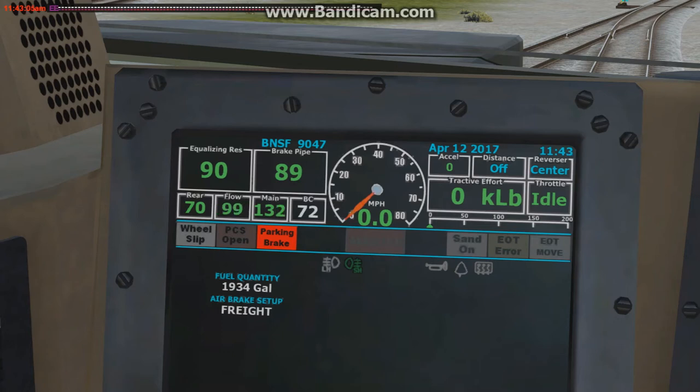Now let's release the air. Give it a minute — it should come up. It'll detect the flow of air, and there it is: the air on the EOT has changed. Now you know we're getting a release, but you need to make sure all the dashes in the graph turn white to show the cars have released, because you need both an apply and a release. You can see the air changing to yellow at the head end and it'll slowly move throughout the train.